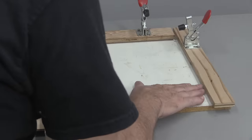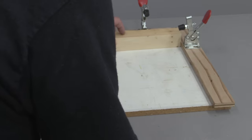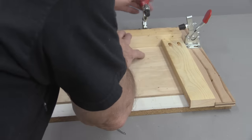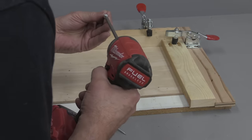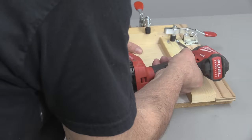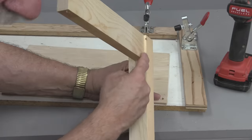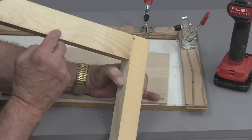Here's another example using a clamping frame — you could make one of these yourself. For example if you're making case furniture with square legs and you're looking for a specific reveal, say a quarter of an inch, you can align and lock it down and get perfect alignment and a perfect reveal because it's clamped. You could do that with every one of the legs on the project.